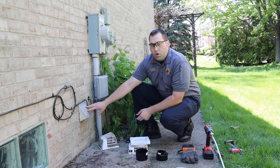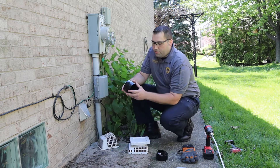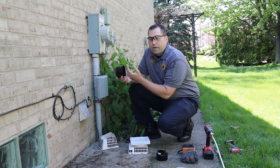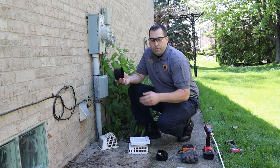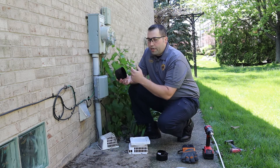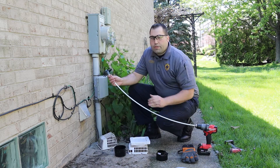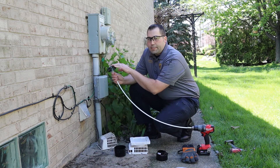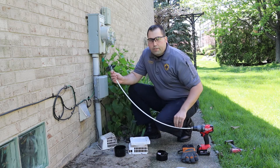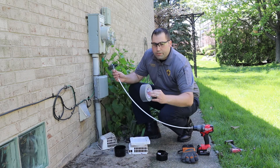With this style, it's not removable from the home, so we have to change things up a little bit. We can use this attachment — hook it into the vent and hook it back into the dryer, then turn the dryer on a non-heating cycle to move some air through while you're using your brush. You can also use a shop vacuum in the reverse position so the air will blow out. When you're using your brush, there's a set screw on the top that you want to tighten down so that you don't lose your brush head. When adding additional lengths of the flexible rod, you want to put some tape on it to secure it — either duct tape or electrical tape.